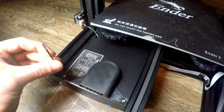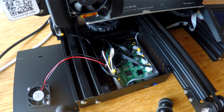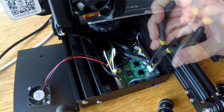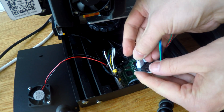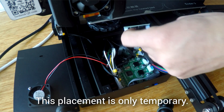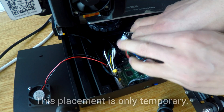Our first step is to slowly slide the bed back and forward to access the three screws above the electronics tower. Sit that aside without unplugging the fan. I used pliers to remove the hot glue that was holding in the factory extruder plug, then plugged in the lead for the TL smoother and then the original extruder plug into the other side of that. Make sure you put the fan cover back on to stop debris from getting in during printing, and that's it — no firmware, no software changes needed at all.